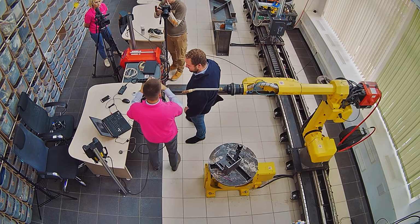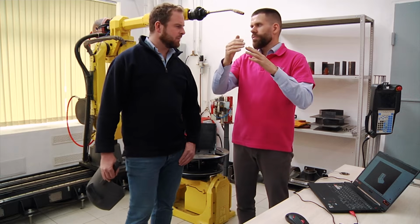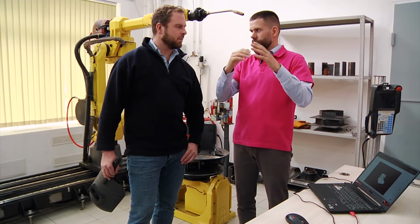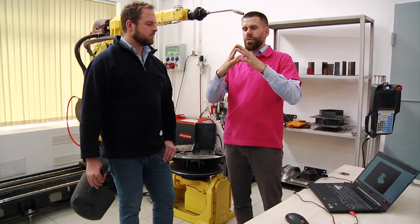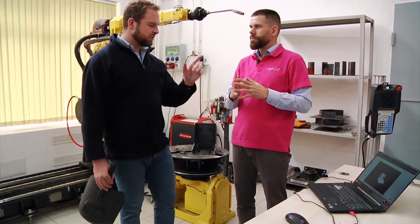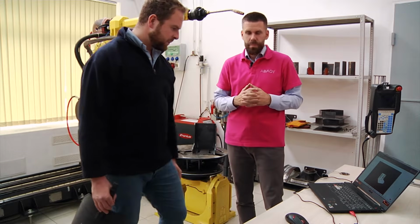But if you stay for a bit longer, the metal will float down, right? Too much goo. That is why you need to move from the center to the side. And also you need to heat up the side wall in order for the fusion of the metals to occur, okay? So the metal will stick to the wall. Another parameter is how long you stay on the side. Also there is a parameter of how fast you move overall, okay? Is it easy to choose these things on the system? How do you choose those things?